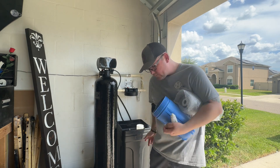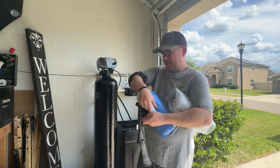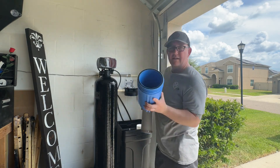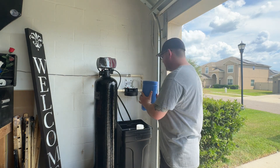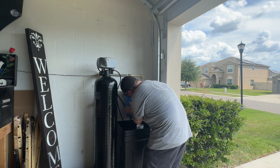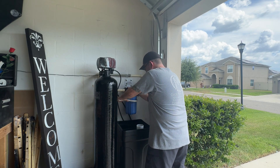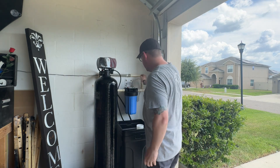Once you've got enough grease on there, your rag comes back in handy. Put the lid back on your grease and set it aside. Now it's time to open your new filter — it literally just sets right down on top of that. Slide it in, make sure it's fitted, and the housing goes on the exact way you took it off. Give it a nice tight turn, brace it, and use your wrench. You don't want to go too tight because you don't want to break that housing. But now you're good to go.